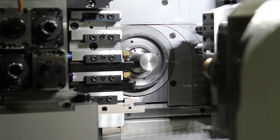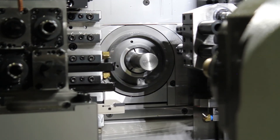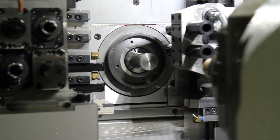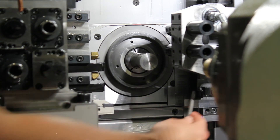From there, that tool is qualified in the X axis. I can now call up G28U0 to send it home. It is easier to call G28U0 rather than moving the axis if you are unsure of which direction it will go — that way it is always going to come to its home position in between the front side plate and the rear side front angle.